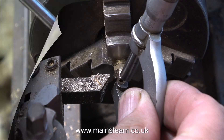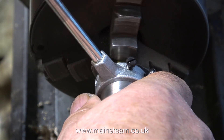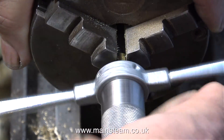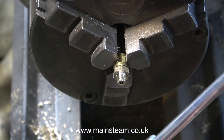While I've been talking about the happy place known as the Lunatic Asylum where life is wonderful all the time, I've been machining the other end of this piece of brass hexagon down to 3/16ths of an inch in diameter, and I'm currently threading it 3/16ths by 40 threads per inch using my homemade tailstock die holder adapter, which again speeds up the job.